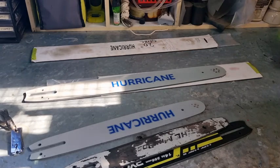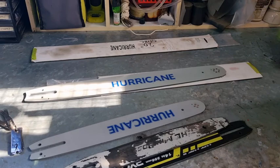You need to have that sort of gap for two reasons. If you don't have any gap, the chain will be too tight — it'll take more horsepower and things will wear out quicker. Also if sawdust builds up too much in the guide rail you could jam, and I've had that happen to me where I've been cutting wet timber and the sawdust jammed up in the bar rail. So you've got to have that working clearance — it's roughly 10 thou. What I've found from different manufacturers is that the bar gaps for 063 gauge can be approximately 1.75 millimeters, sometimes getting closer to 1.8.